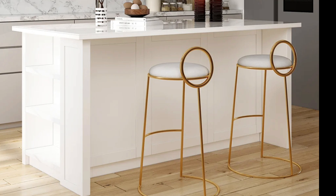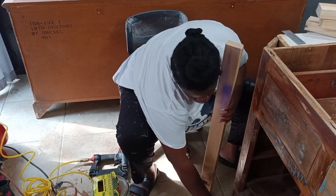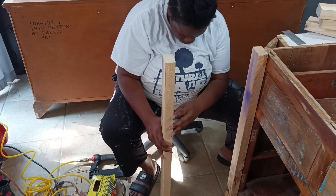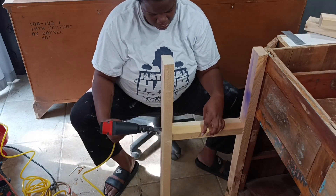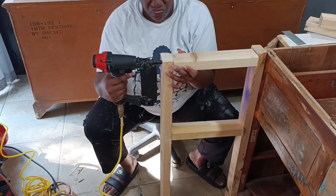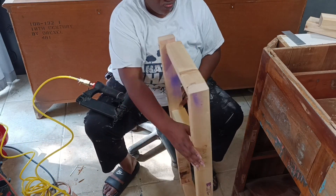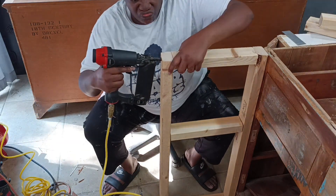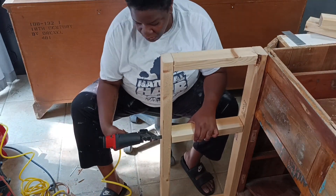Here's where things started to go left. I saw a photo and thought it would be nice to have an area that's kind of like an eating surface where you can sit with bar stools. I liked that it protruded on the sides, and I knew I would need some kind of support for the top of the island for the part that hangs over. So I built a rectangle out of two-by-threes — fairly simple, I just nailed it together with a piece across the top, a piece across the middle, and a piece across the bottom. I'll panel over this as well, but I don't have enough panels for this last-minute add-on and I'm going to have to go back to the store to get more. And since I already cut my top based on not having this overhang, I'm feeling like I might be kind of screwed.